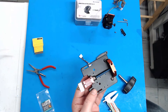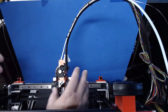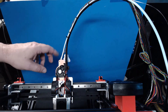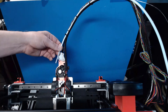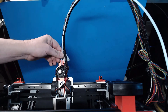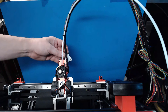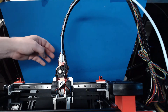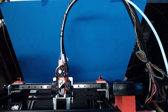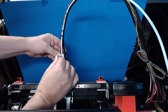Next, we're going to go over to installing this all onto the printer. You've got your Orbiter and everything installed on your printer. Now you've installed your Orbiter — take your remainder of PTFE tubing coming from your old extruder, install it into the Orbiter, and install the locking clip. Make sure it's nice and tight. You've got these two holes here — you can design your own, or use my steel band wire support, which keeps the PTFE tubing and all the wiring in a nice smooth arc from the extruder. This gives you something to help keep everything nice and supported.